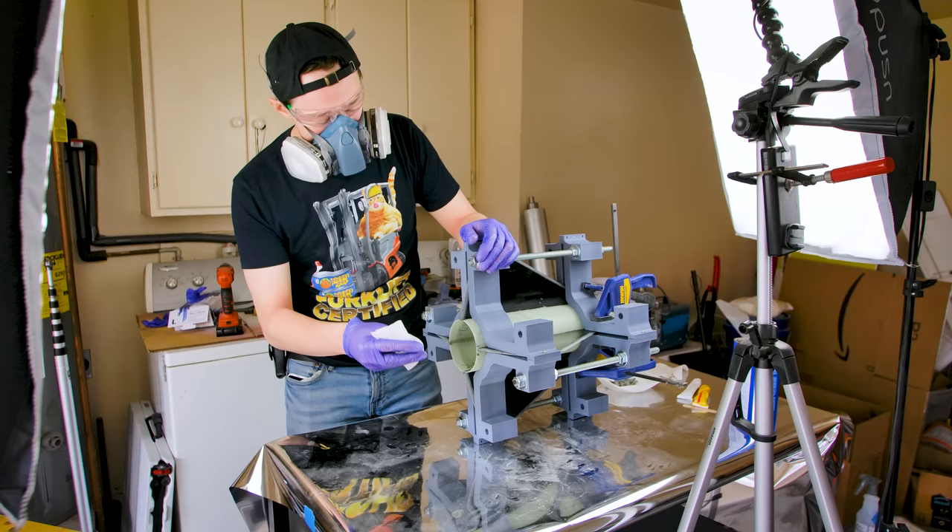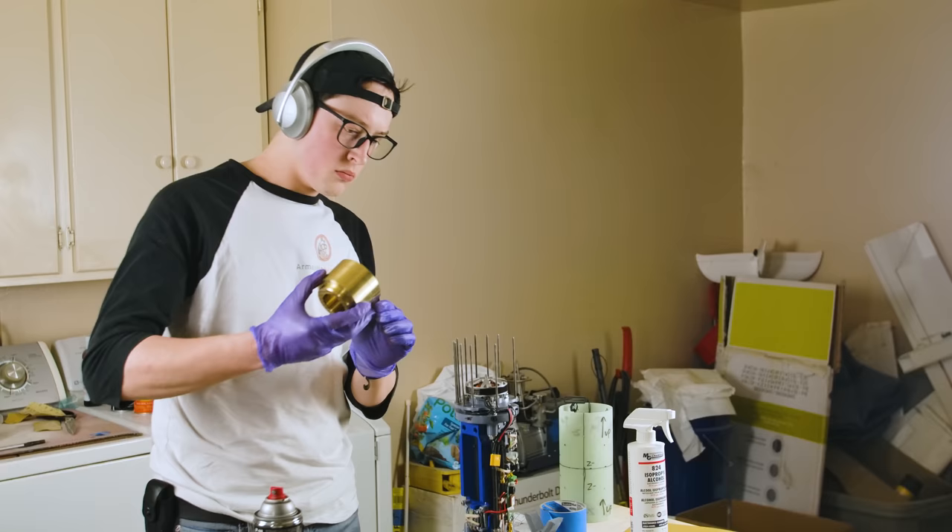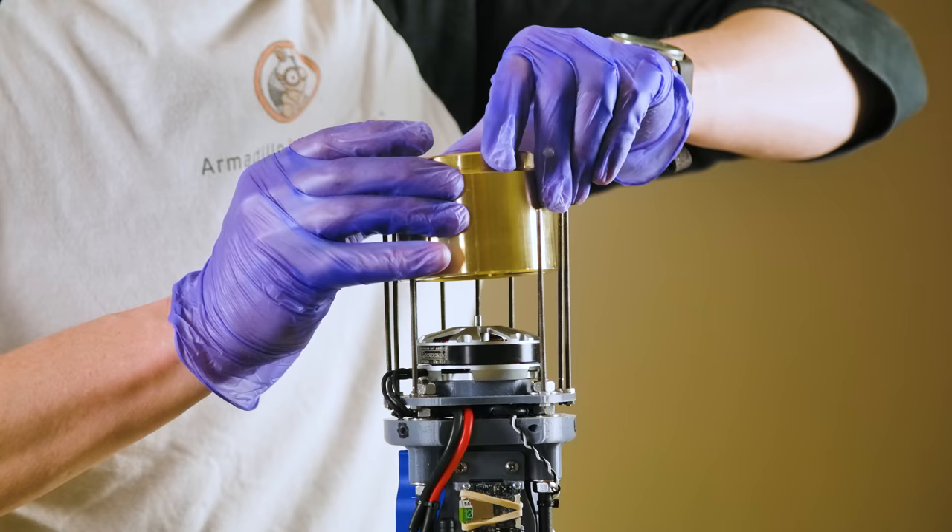It's important to put thought into how straight your fins are — not just for pitch and yaw reasons, but because we have a reaction wheel on Lumineer to control the roll axis. Any misalignment in the cant of the fins is going to make the reaction wheel's job harder. As it turns out, when you go Mach 1.6, even a small misalignment is that bad.